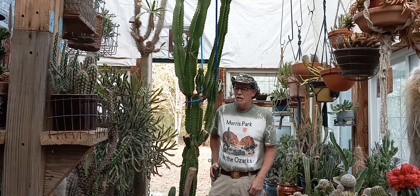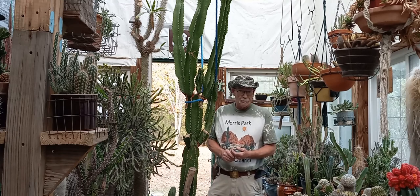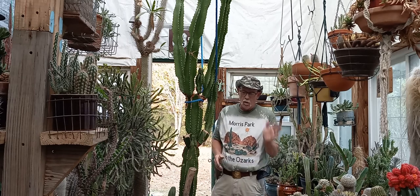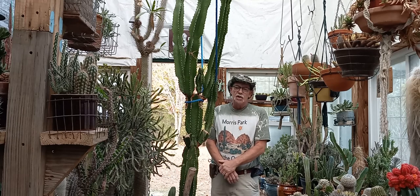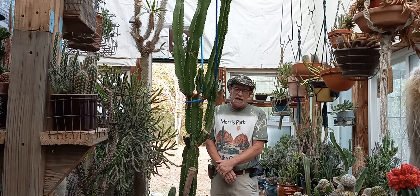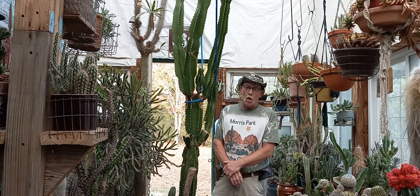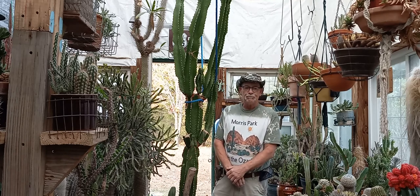And when I mean ready, that means going through a checklist of things like my stove. Stove has to be ready, and what I usually do is take the switch plate off the thermostat. We got a few mosquitoes in here. Switch plate off the thermostat, check it, and what I usually do there is jump a wire over the thermostat to see if the motor is going to be running. See if that motor is still good. Make sure, because you don't want a surprise when it finally gets down cold, and then you have a problem. So I've done that. That's working.